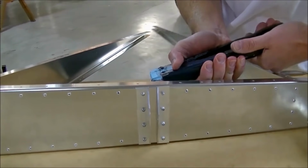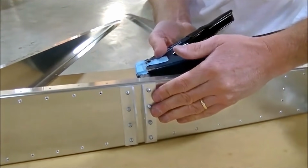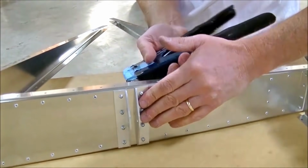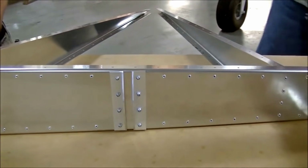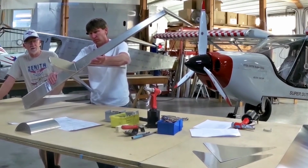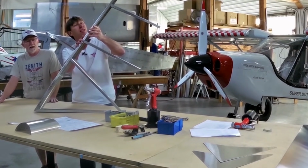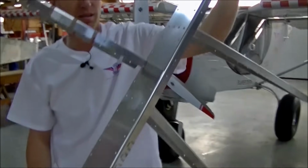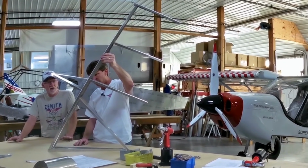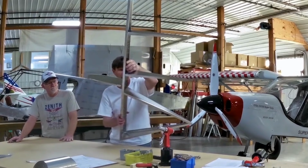Now, if I recall, in the regular rudder kit, we only add the upper and lower horns later on. So we're actually doing more on this CH750 Super Duty rudder, aren't we? Absolutely. Not only that, the upper hinge point is pre-drilled and pre-cut for our customers. Previously, you would just get 2 pieces of extrusion and you had to drill them and cut them to shape yourself. So this is the finished rudder skeleton assembly. Correct, that's what we call the skeleton. Wonderful, it's done, it's ready. So what's next? Well, we're ready to lay out our beams and then start skinning our rudder. Yep. So we're going to lay this aside for now.